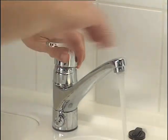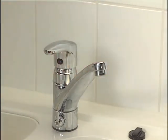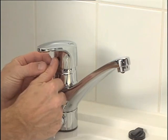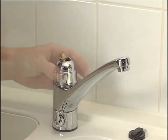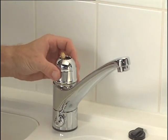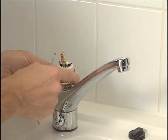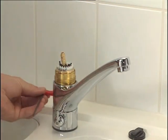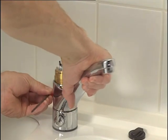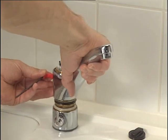The spout swing angle of kitchen faucets is factory preset at 100 degrees. If you want to remove this limitation, do as follows: detach the lever and unscrew the cap, detach the upper collar ring, and attach the spout. When you lift the spout, simultaneously push the limiter pin at the back of the faucet to detach the limiter pin from the faucet body.